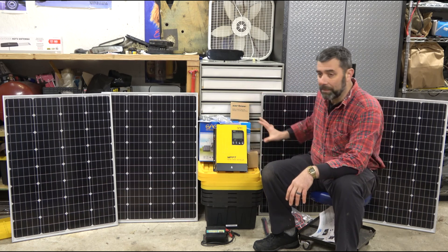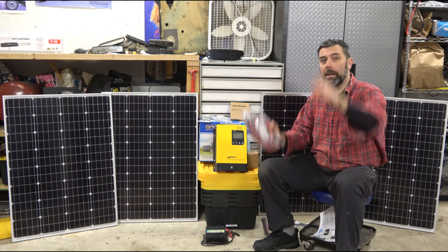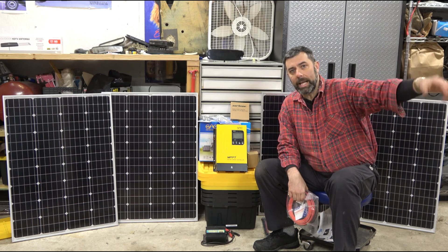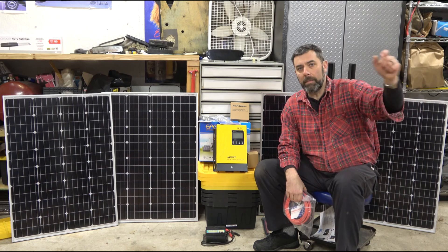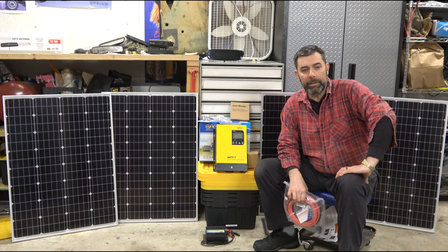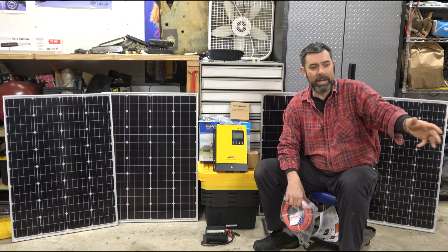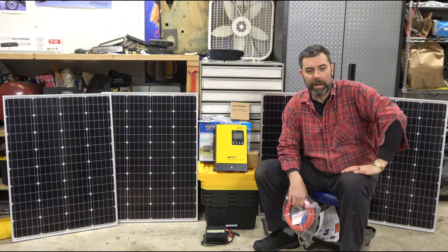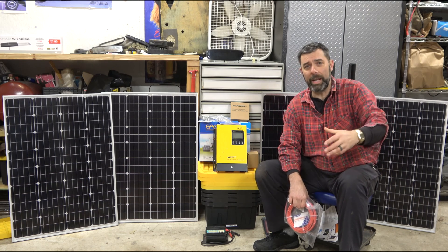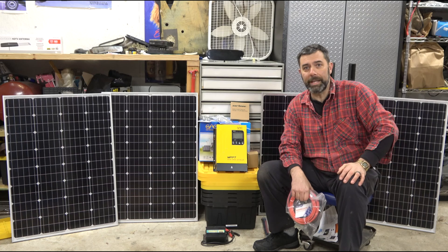We'll get a piece of plywood and mount everything together when the inverter shows up. We'll run our wires and figure out placement — probably a long wire run down from the roof with a panel right here in the garage. I have a fuse box out here; I'm going to cut over the garage to solar power. Other than the lift, which is 220, the rest of the garage runs on 110. I'm considering whether to convert the lift to 110 — it shortens motor life slightly, but run time is very low, so it may not matter much.